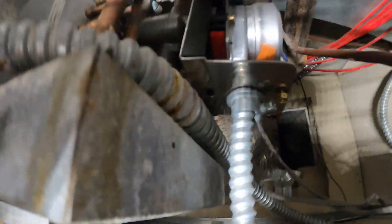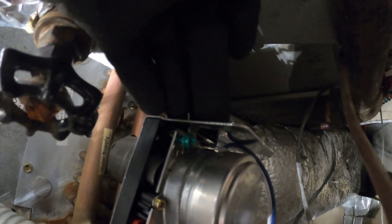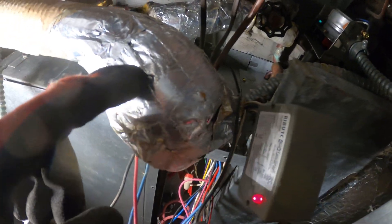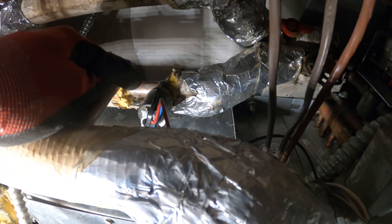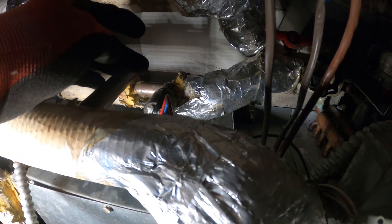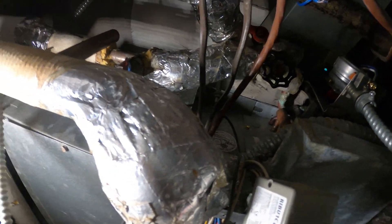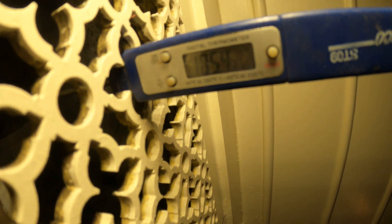I'm trying to get the camera in there for you to see — this is loose. The valve just opened! It's because the pipe sensor was sitting on the drain line instead of on the hot water pipe, so it wasn't sensing any heat and it wasn't going to open. Because we have emergency electrical heat in this kind of system. Got my thermometer at the supply grill — we're at 106 degrees and climbing.